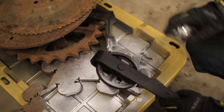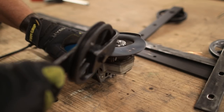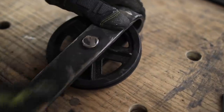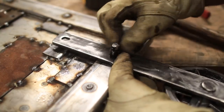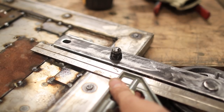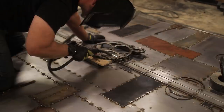With the wheels being plastic, grinding on them like you would on steel wouldn't do anything, so I used a can of silver spray paint to give them a metal look. To attach the hardware, I drilled a hole for the top bolt only to use as a guide, then squared it to the door using my combination square and welded it into place permanently. I was afraid that because this hardware had room to adjust up and down and the doors being so heavy, they would get out of alignment over time — so a couple of welds made sure it wouldn't shift.